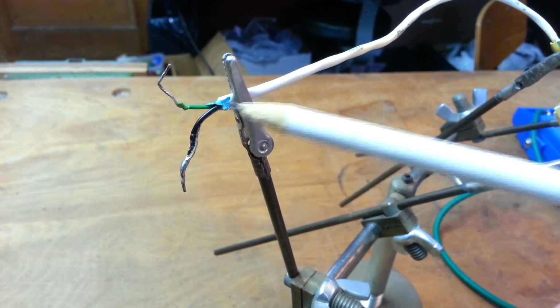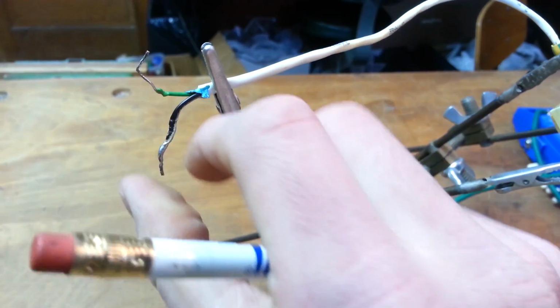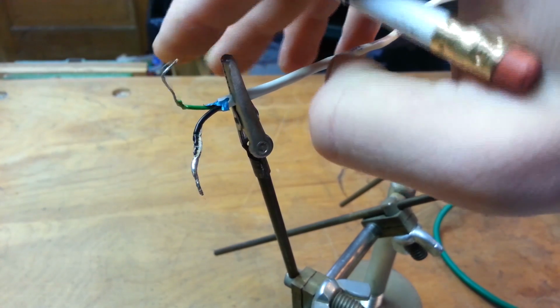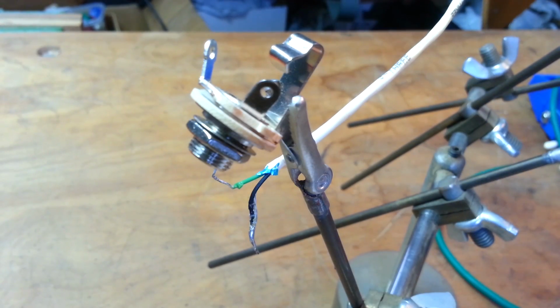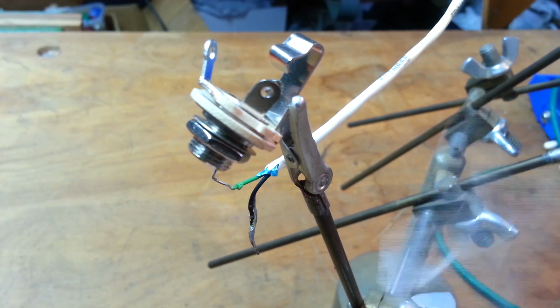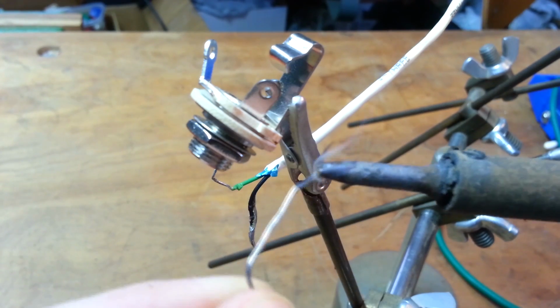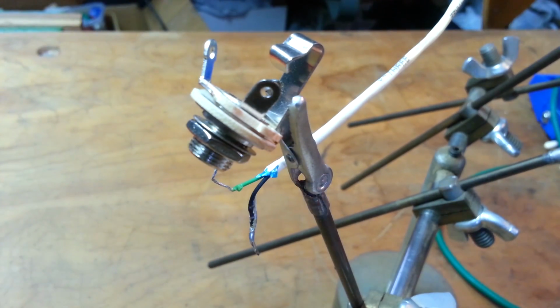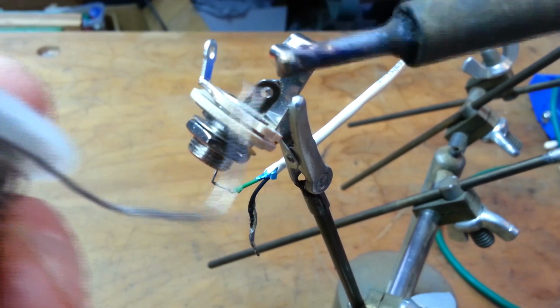So if you look, he's got the shielding lead wrapped with presumably the negative lead, and that would be positive. For your soldering iron, you always want to make sure that the tip is kind of silvery, and to get it evenly coated on there, wipe it off on a damp sponge and redo it periodically. Fortunately, my sponge is not really damp. It seemed to do it. So anyway, if your soldering iron end looks crappy, maybe it's time to get a new one.